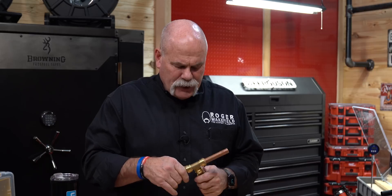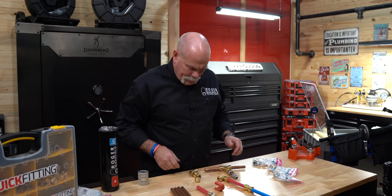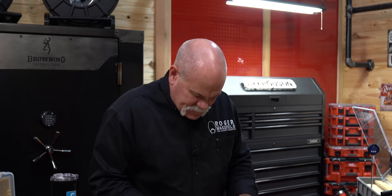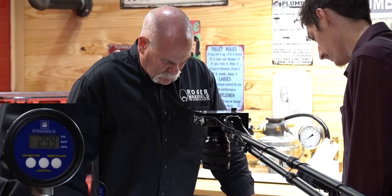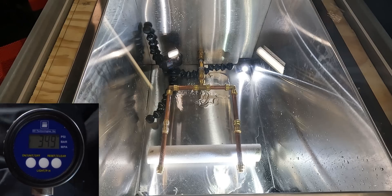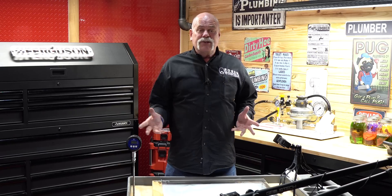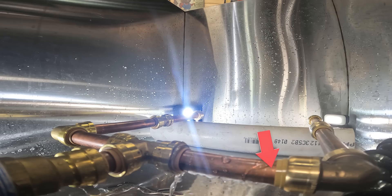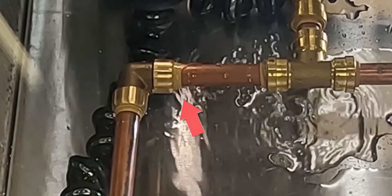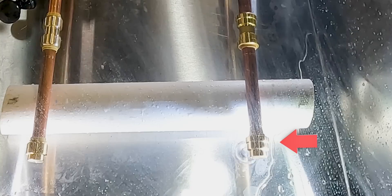This T is still in place — it's already been used, so we understand that. Remember, this has already been pressure tested to almost 1,000 pounds with PEX pipe. Now we're going to do it with just copper pipe and see what it does. Our SharkBite 90 blew out at 900 PSI — it didn't blow apart, it just started leaking and spraying really hard. And the cap on the Quick Fitting started dripping. We're not sure if the movement caused what, so let's see what else we can do.